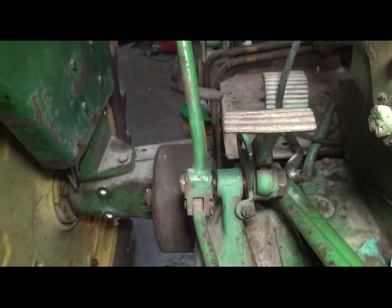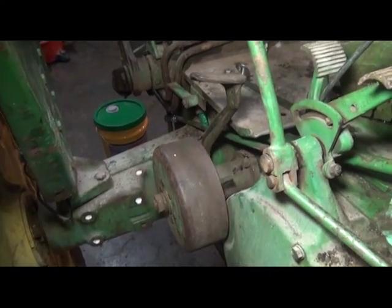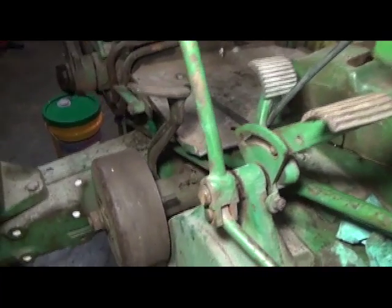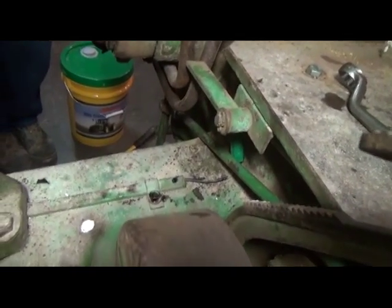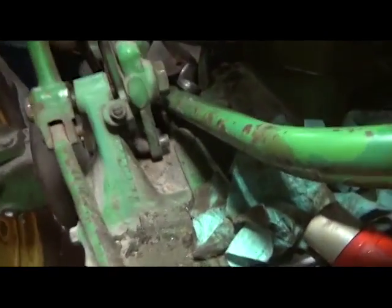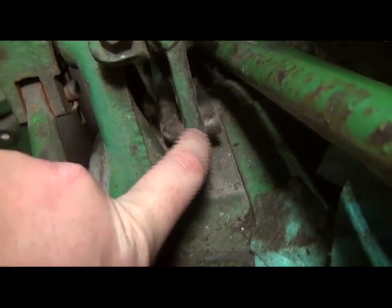Alright, so we've assembled the power shaft clutch and housing in the tractor. We've set the end play on the power shaft bearings. After replacing the drain plug, I took out this plug and filled the power shaft with 303 tractor hydraulic transhydraulic oil. John Deere's book is going to say to use a 10 weight oil.